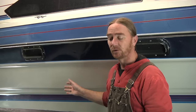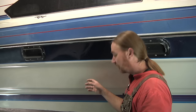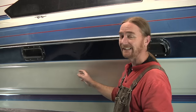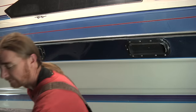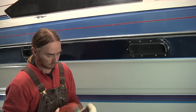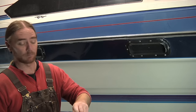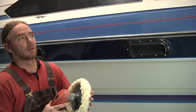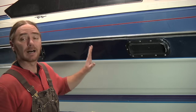On this white area down here I'm going to be switching over to the Meguiar's oxidation remover. I really don't see any advantage to using that heavy compound on the white — by looking at it I can see that it's in much better condition than the darker gel coat. So the white doesn't need the very aggressive stuff and I'm not going to use it. I'm going to switch to a new clean pad. The Meguiar's gets run at a much slower speed — it does not need to be run screaming fast like the AquaBuff. If you run it too fast, it's going to dry out too quickly. You want to run it slow and let the compound do the work.